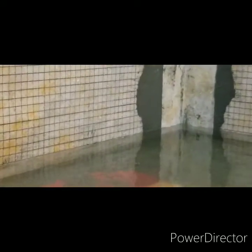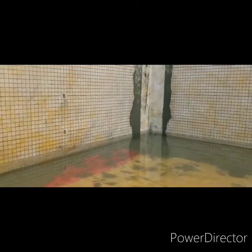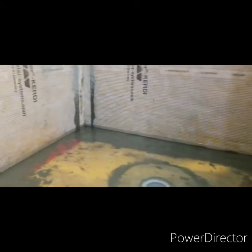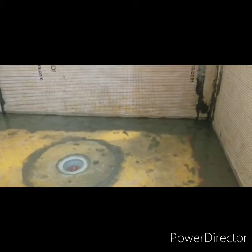I don't know if you can see it, but I got it right up to that bottom line on this side. And then I made a pencil mark there right at the water level. So it's about, I don't know, 7 o'clock now, evening. So we'll let it sit overnight, at least overnight. And I'll check it in the morning when I get up and see if this water level has dropped any. If so, we got problems.